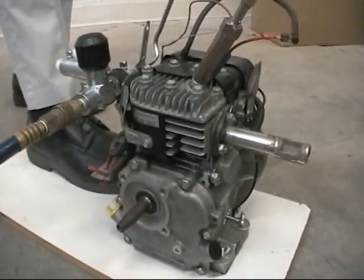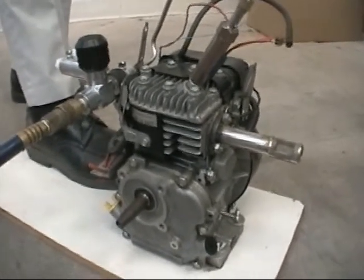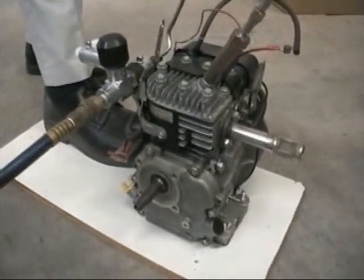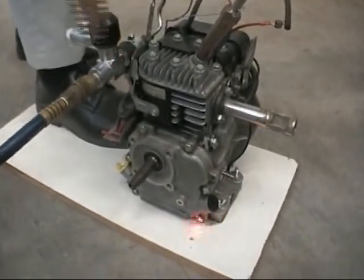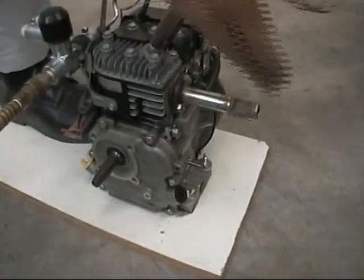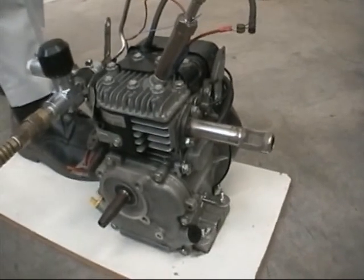And that's part of the TESI system, which we'll see on the DVD as well. It is part of the TESI concept of making virtually 90% or more utilization of the hydrogen that you bring to this engine for either motive power, electricity production, space heating, water production, because the water can be condensed here at the rate of 9 pounds of water per pound of hydrogen.